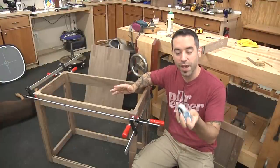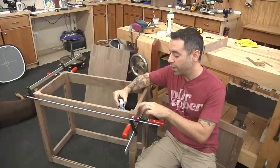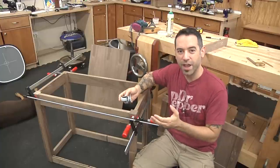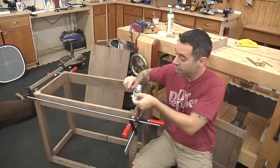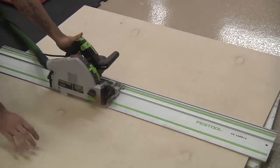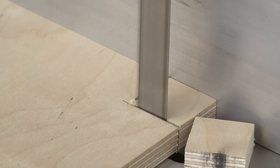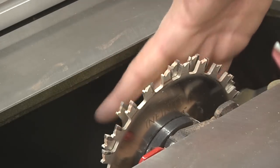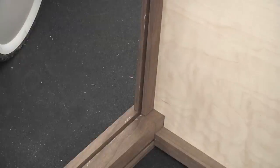With the entire assembly upside down, we need to talk about the bottom panel. Basically, measure to size, account for the grooves in the rails it will sit in, and notch the corners to go around the legs. The real important thing to think about here is the casters. If you're going to have a rolling hamper, you need to have that bottom panel up high enough to allow the wheel to sit in there, making sure it doesn't rub on the ground or lose clearance when moving from a hard surface to soft carpet. With a two and a half inch wheel, I'll place my bottom panel up two inches — that gives me a half inch of exposed wheel to get over various terrains in the house. The half inch Baltic birch panel is cut to size using a circular saw, the corners are notched at the bandsaw, and we use the dado stack at the table saw to cut the grooves in the bottom rails using special shims to get the exact dimension needed.